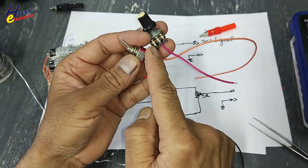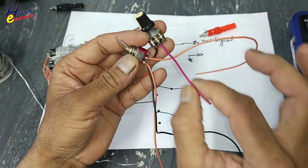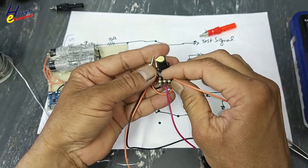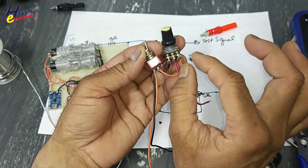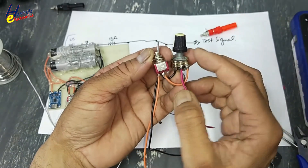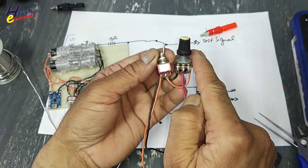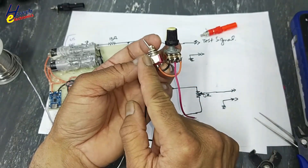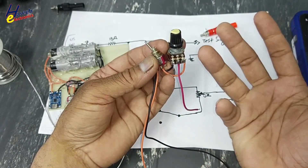Output — minus 3.7V here. This potentiometer will receive voltage when we turn on this switch in this direction, closer to the potentiometer. If this switch is in the off position, the potentiometer will remain out of the circuit.